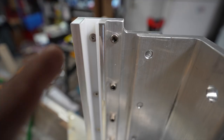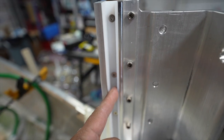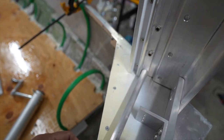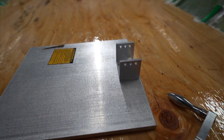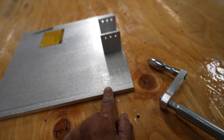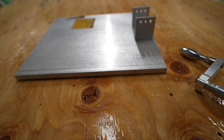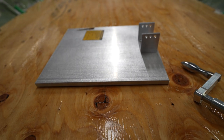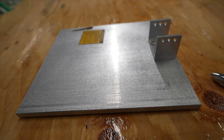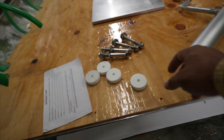Inside, you have a UHMW plastic sleeve fitted in there pretty nicely - that's where the jack plate rises up and down on the fly. You've got the mounting stack and the cross beam that holds the whole thing tight. With a lot of other jack plates, they're just not really good for portable tillers - they're meant for boats you can permanently mount to. But this is just one flat plate, and that's what you need when retrofitting a jack plate for a portable tiller with clamps. Comes with a warranty card and a detailed instruction manual.